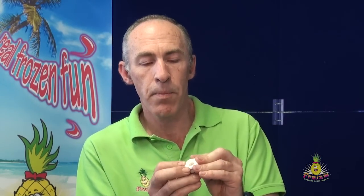The other leaks that you will find are more serious. They generally involve a black or dark, usually very thick product running down, possibly underneath the actual bowl itself into the tray, but generally more into the back of the machine, or even down behind the machine or underneath the machine onto the bench. This is caused by, in the first instance, this seal that's inside your spiral either being worn out, like this one is. It will turn back on itself very easily. This one's out of a Cab Faby machine, or it hasn't been cleaned, it hasn't got sufficient lubricant on it.